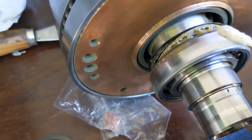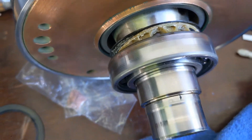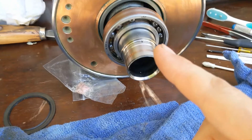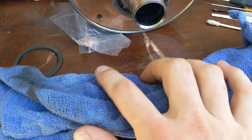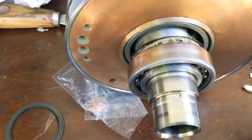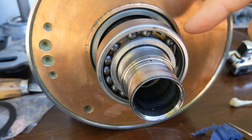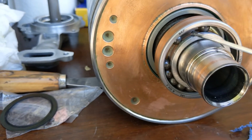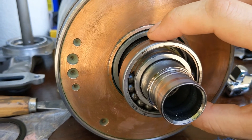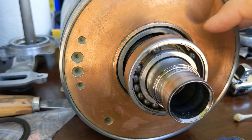Accidentally while cleaning, I pushed — not even hard — and the cage came out. So be very careful with the ceramic balls; you don't want them to drop on the ground in case they chip. If they fall out, keep them contained so they can't roll off the table. But now we can take it apart completely and clean it even more thoroughly. Fortunately the balls just stay in between the inner and outer races and cannot be taken out unless you apply a lot of force, which I'm not going to do.